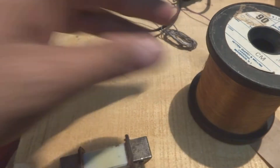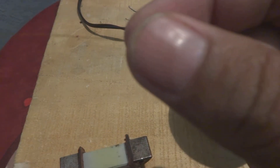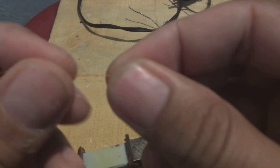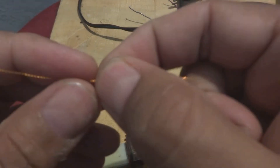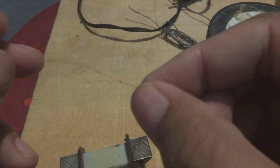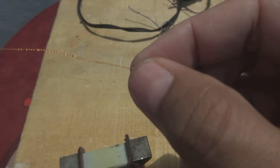This is the roll, and here is the wire. This wire is actually like human hair, or a little bit thicker than human hair. Here, you can see the thick side — this is three wire strands actually. I just put them together and made it a strand like this for the terminal, because I am bringing this to the earth terminal. So this will be the end — that's why I made it a little bit thicker for the mechanical strength.